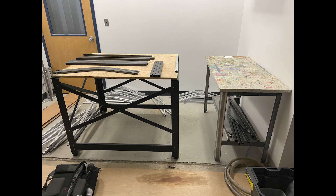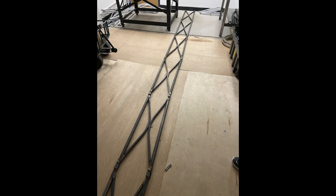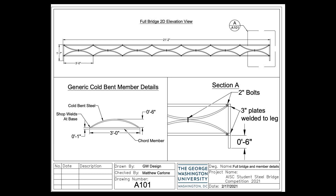The transverse section of the bridge proved to be the most complicated though. The design team would have liked to connect the transverse bars to the same nodes where the bays were connected to each other for the truss, but ultimately we decided that this would have created too much activity in those areas and likely would have caused some sort of failure at the connections due to there just being so much stress at those points. So in the end we decided to offset the connections for the transverse bars a few inches to either side of where the truss bays connected to each other.